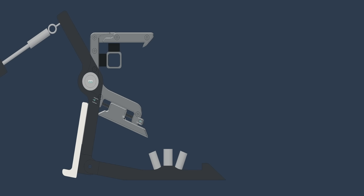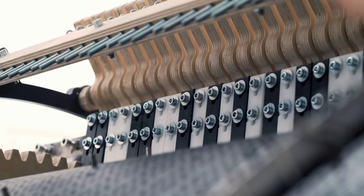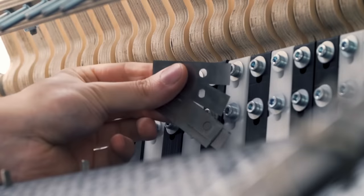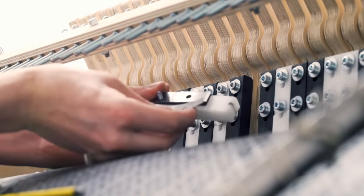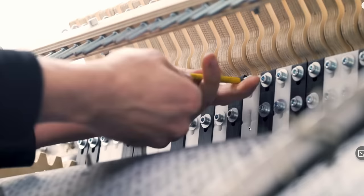The adjustability. So we can move this part left and right for adjusting. Here's the method I used on the Marble Machine X. So behind these Delrin parts, I had these 0.1 millimeter shim parts that were custom laser cut. And then I had to open these screws and change the number of shims to adjust. So here's the real problem, enhance.